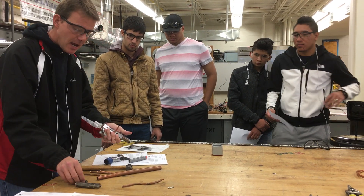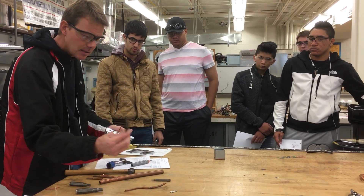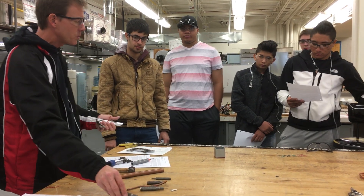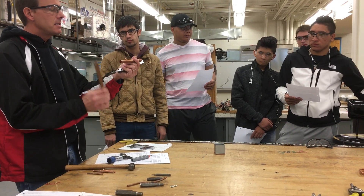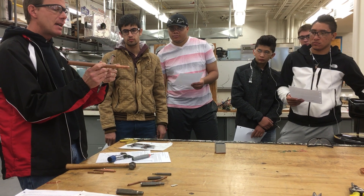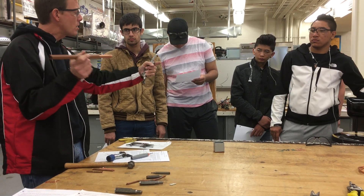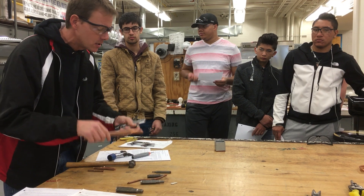I can't fit the swage punch in without reaming. There's a quarter-inch swage, matching up all the measurements you've been learning — three-eighths inch swage, half-inch, five-eighths. That's about as far as we're going. There's some three-quarter-inch pipe lying around but we're not going to do that. You're going to do the five-eighths. Notice how this telescopes in — the five-eighths fits inside the three-quarter. I can fit a piece of half-inch in the five-eighths, and three-eighths and quarter, just like the flare tree. They all telescope — that's what that's called, telescoping.